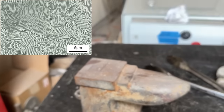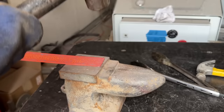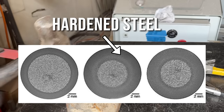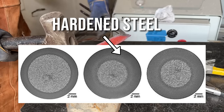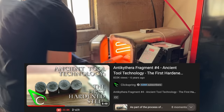It changes from pearlite at room temperature to austenite. This changes the crystal structure of the metal. At the same time, the charcoal has begun to release carbon as it reaches this temperature. The longer you leave the metal in the furnace absorbing the carbon, the deeper the hardened case will go. I watched a video by someone who's a lot smarter than me, and he said that 20 minutes did the trick.